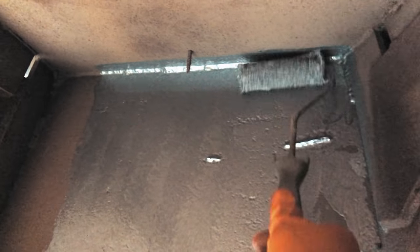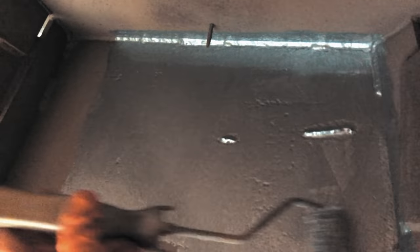Right up in the fuel tank now, you can see this paint flows on really, really easily. I'm putting it on quite thick in the corners and then rolling it out. I really want to get under these ribs — I don't want any mild steel exposed there. I'll push it on quite hard, then thin the paint right out when I roll it. You can see the surface profile: it was rusted, sandblasted, and it's quite dark now. The viscosity of this paint is quite thin, which is a massive advantage because it really gets into all those little spots.